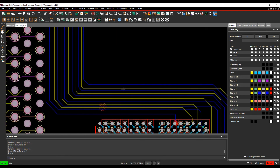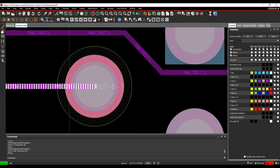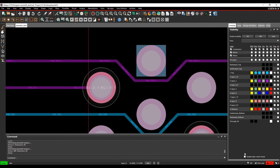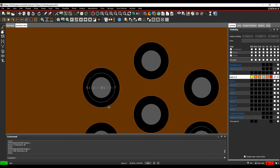Once back-drilling is applied, graphical representations appear on screen: keep-out areas, and back-drill layer identification labels such as 'layers 1 to 2 must not cut 3' and 'layers 10 to 8 must not cut layer 7.' Under Setup > Design Parameters, you can enable back-drill hole visibility to physically see the back-drill hole and drill labels. You can also switch the layer select mode — for example, to Solder Mask Top — and see a slightly smaller opening for back-drilled holes. Anti-pad values are also dynamically visualised.